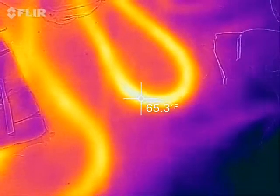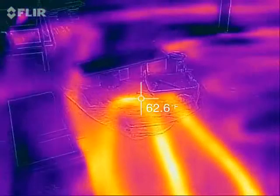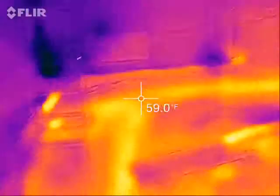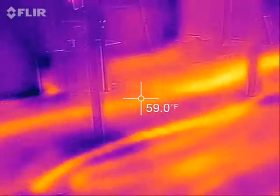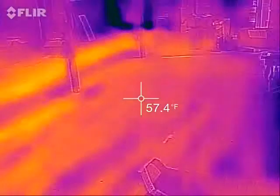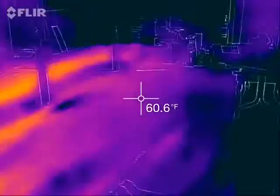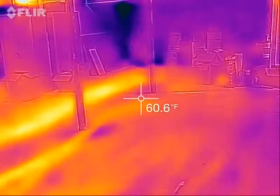I just bumped it from 63, and you can see right where the first couple of loops are — they end up dumping quite a bit of heat right in that area, then they cool off as they go. You can look for the temperature to see where the loop is going. As it gets cooler, particularly on this side, that's actually a good spot because right over here is the south wall, which is going to get a lot of sun and warm up anyway, so that's not a bad way to go.